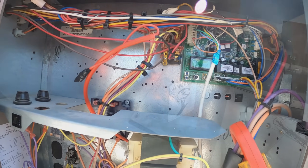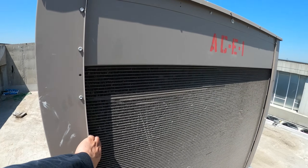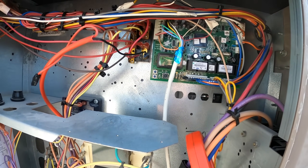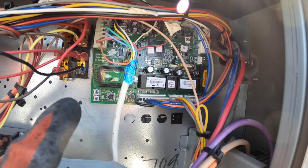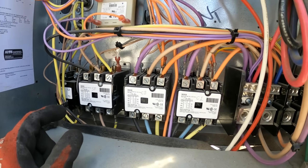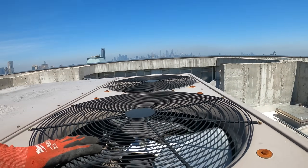Just tightening that screw quieted it down. Both fans are on — that's good. I really want to clear those lockouts though. This cage is rattling like crazy with a lot of vibration — that's probably why that coil ruptured. Looks like all these screws are loose. This thing is running though, even with sensor failures. I'm going to go into the menu and erase the lockout codes.